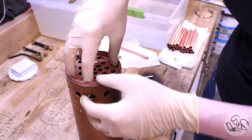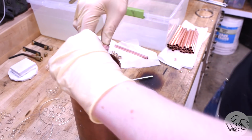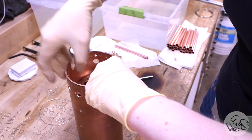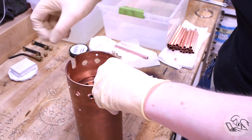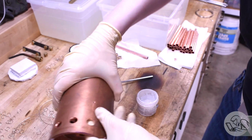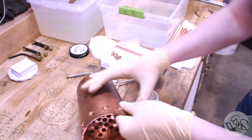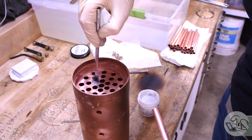And if you use one of the simpler mechanical methods like swedging or flaring, you do still have to use a caulking of some sort, which is often soft solder. And again, that's not considered safe for long-term use in model boilers. So silver soldering is by far the easiest way to get a result that is safe and will stand the test of time. And that's how model engineers have been doing it for a long, long time. And I'm fairly new to this, so I don't know enough to question established practice. So I'm going to do it the way people say you should do it.